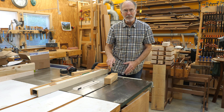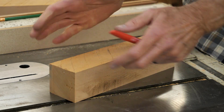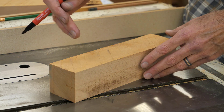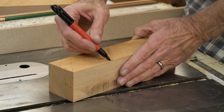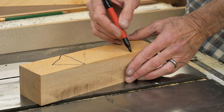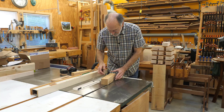Usually I mark the parts before cutting, but sometimes it's easier afterwards. I want to note the orientation of the parts — I've got it back the way it was originally. Once I cut out the center part for the blade, I need to know where the front and back go. So I'm going to make a triangle mark here towards the front, and another towards the back, putting two marks at one end to distinguish them.